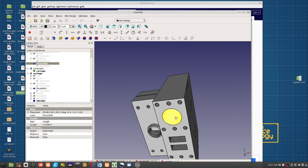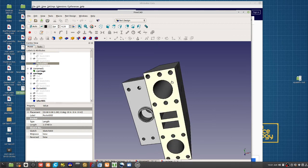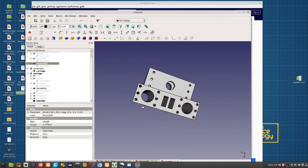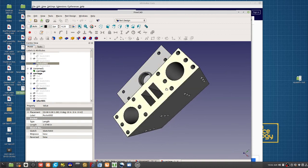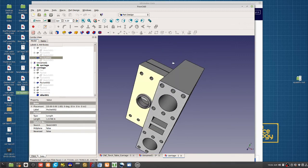What I would suggest is, before, when we had a carriage, you slip in the bearings from the same side. Here, I would cut out your cut for the bearing here, and then cut it out from the other side and use multiple closures. That's easy so that you don't have this long hole in there, because then you would need a spacer between the two bearings. So just cut out a hole of 1.25 inch. Review this video. I think you joined a little later, but if you review this video, I showed how to do that.